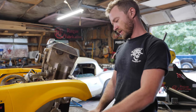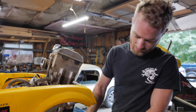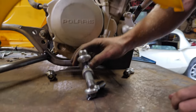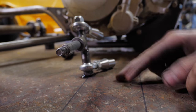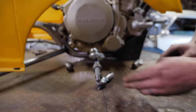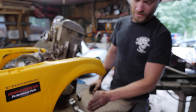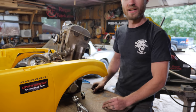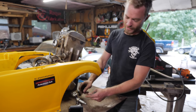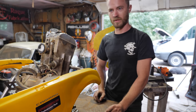I was thinking about how to make this side exactly the same as the other side, and then I realized that's why I built a welding table. I took the bolt for the spindle and tacked it onto the table, measured and got it exactly in the same place as the other side, then tapped it around until it's exactly the same camber and the same caster — just pointed in the opposite direction. Now I can build the suspension arm around it and it'll be exactly the same at the bottom of the travel.